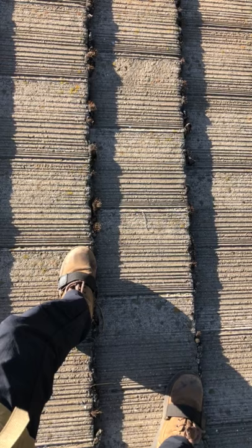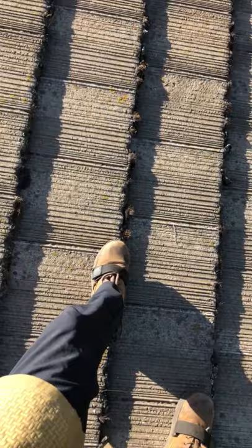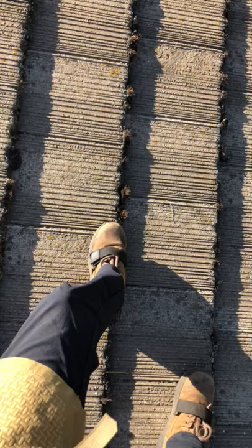In this video we're going to go over safety. One thing to do whenever you're walking on a roof is walk on the part of the tiles that overlap. Where I'm tapping my left foot — do not step on the middle of a tile because it's more prone to crack. If you step where they overlap, it's more structurally stable.